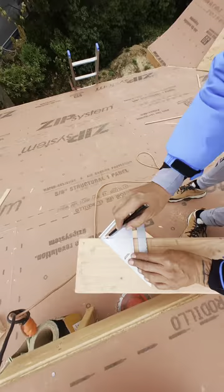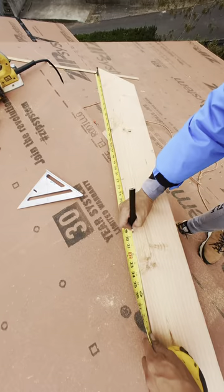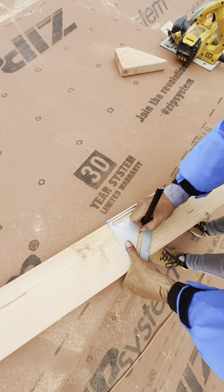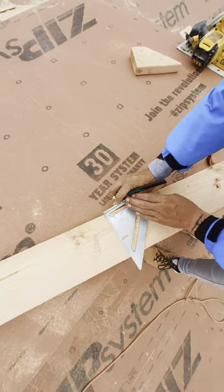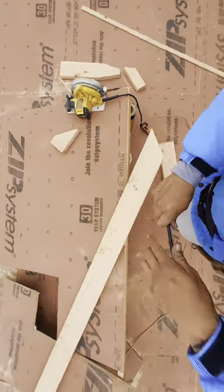29 and a half, 13-pitch roof. 29 and a half. I'm gonna use the same line. This is gonna be the reverse cut. 7-pitch roof, 30 degrees on the skill saw sole.